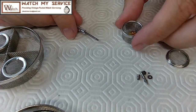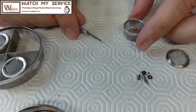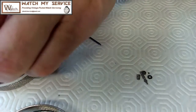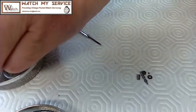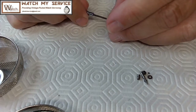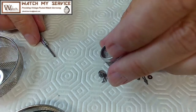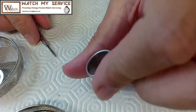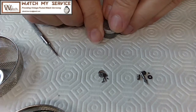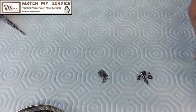I'll reassemble this and throw it back together quickly. That's the cannon pinion, the hour wheel, all kinds of other fun stuff. It's the bridge for the pallet fork. I know the levers are in there somewhere. Look at that — okay, so there's that. Check inside the basket for any screws that might have clung on, and just like that. I'll put this back here.